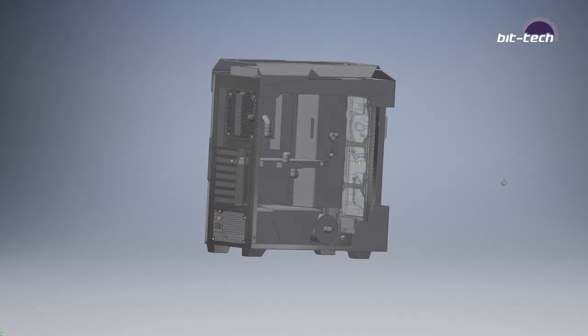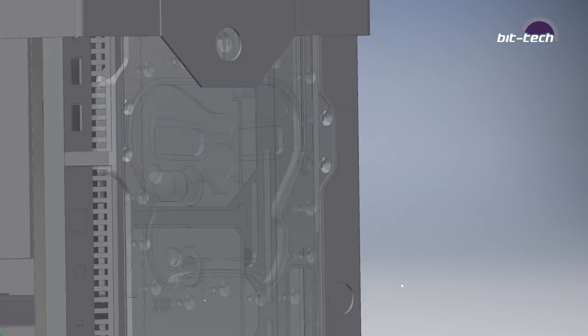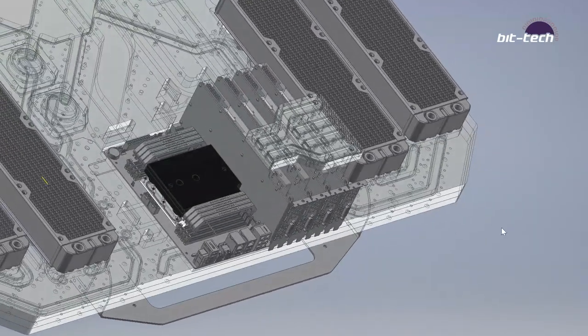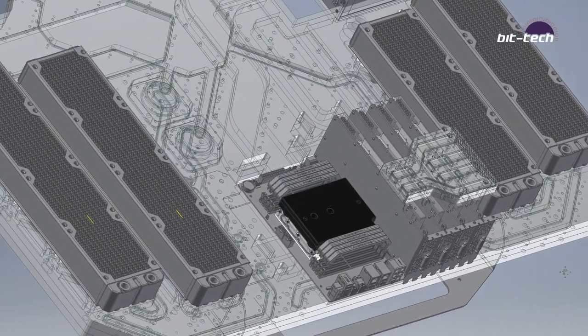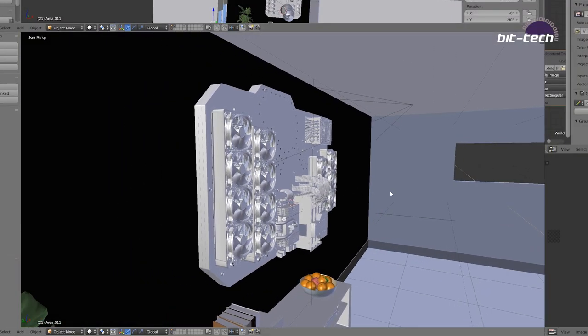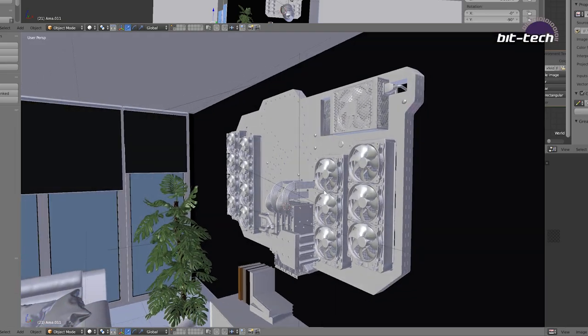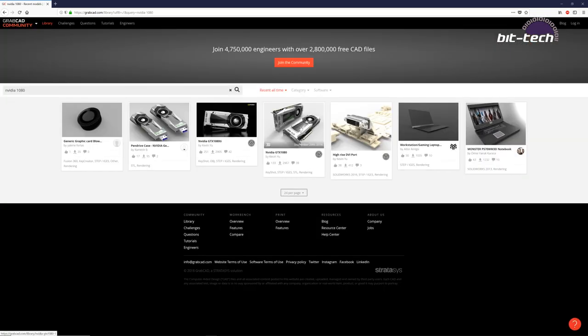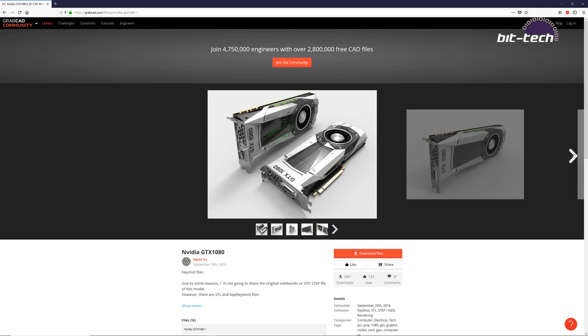Personally, the method that I like to use is CAD. I like to draw all my components up beforehand, model them in extreme detail, and then put all my tubes in a CAD environment. I find it much easier to work through for things like distro plates and other advanced features that I might be machining or cutting later. That's not the easiest way to do it, but it's more applicable than ever now. Whilst I like to model everything from scratch, you can always find files for these sort of things on GrabCAD — they've got loads of options for SketchUp, Autodesk Fusion, and other similar packages.